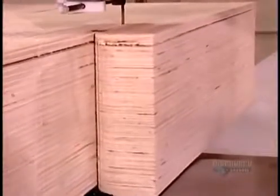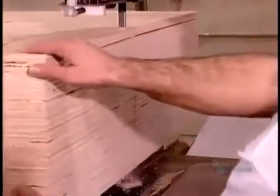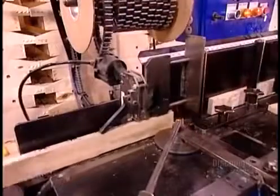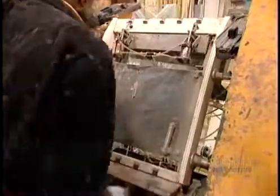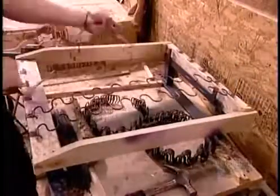Elsewhere in the factory, meanwhile, they cut the frame components from plywood using a computer-guided bandsaw. These long pieces will form the seat frame. A three-seater couch has three separate frames, enabling each seat to recline individually. A machine lines one side of each piece with steel spring clips. A worker then dabs the ends in glue and assembles the pieces, reinforcing them with long glue-coated staples. As the staples enter the wood, friction-generated heat melts the glue. The glue then dries, securing the staples.